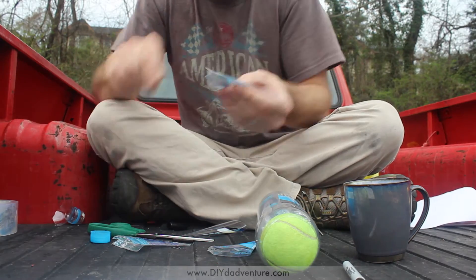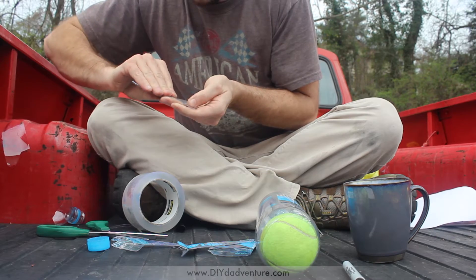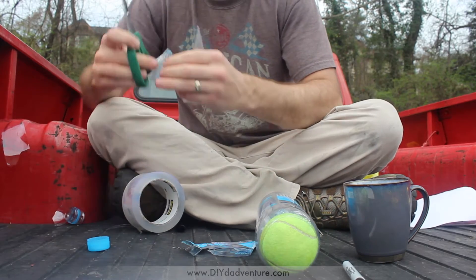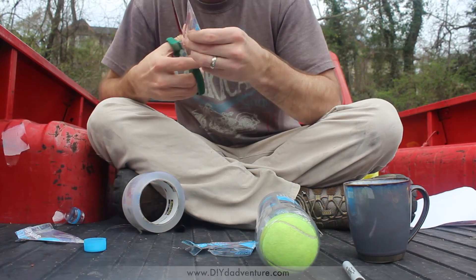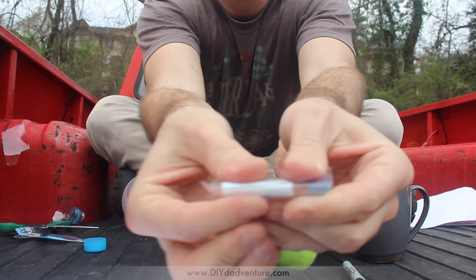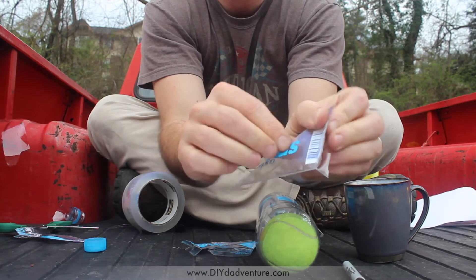So you're going to tape this side and that side. Make sure that both sides are sealed off. Then you want to be able to fold these flanges up. On a couple of these you're going to have to cut into it a little bit right here, just a half inch in — nothing big. You can kind of see here where you fold the flange, and that's about a half inch.